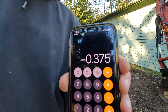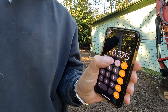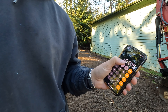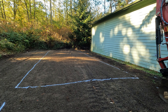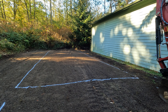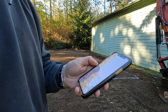Overall it is three-eighths of an inch — that's the overall average height. It is low compared to grade. Grade was this front corner right back here that I measured. So I'm going to drop the height down, aim for about a half an inch low overall. I'll zero out and call this front corner basically a half an inch down and call that grade. Then from there we'll make the rest of it basically match. They wanted us to shoot for within plus or minus two inches, which we're already well within that, but we can do better.